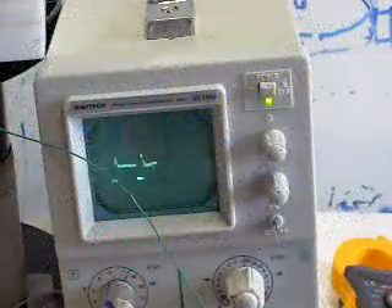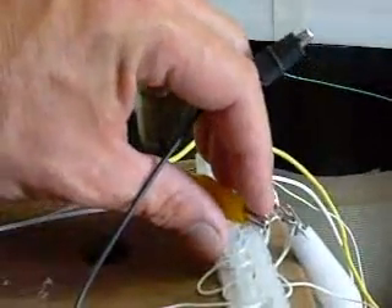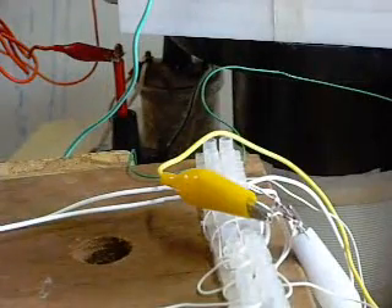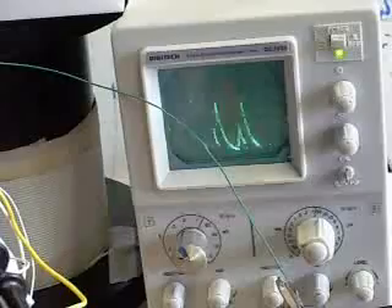Alright, that's our drive coil signal. Then we'll look at what is being made by the generator coils going through this bridge rectifier up here - these are signal diodes. We've got the AC output plus the reed switch breaking the AC coming from the generator coils. That's the DC side.